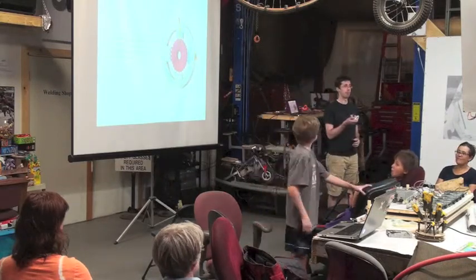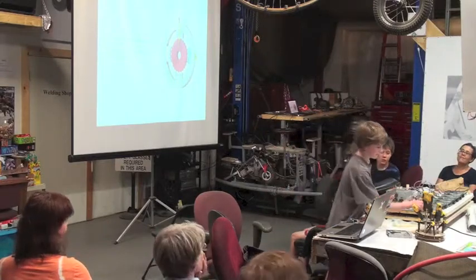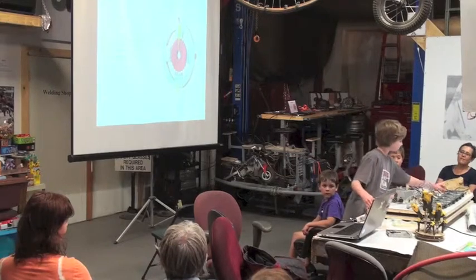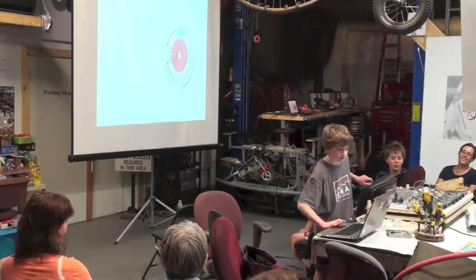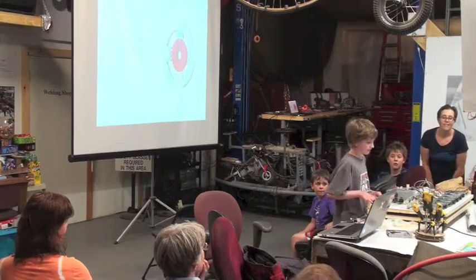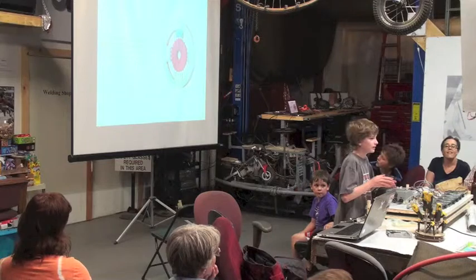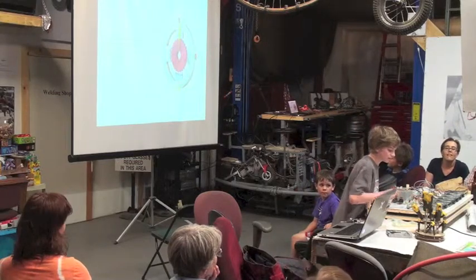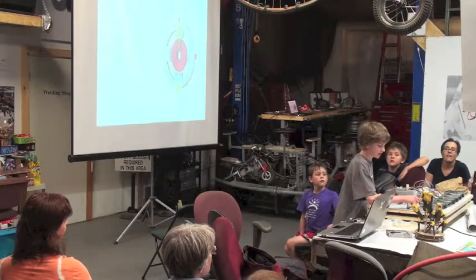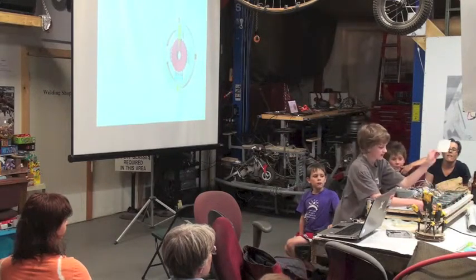Sure. All right. So lately I've been working on my floppy drives. I have a lot of floppy drives here, 8 of them in total. They're going to play music by having the motor step and move, and that will create a tone. It steps in just the right way to create a tone, so the head can resonate. You're not actually going to be hearing the motor. The head is going to be resonating on the drive, the disc internally.